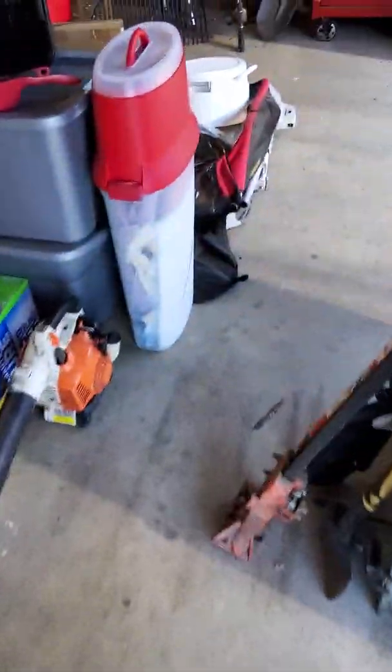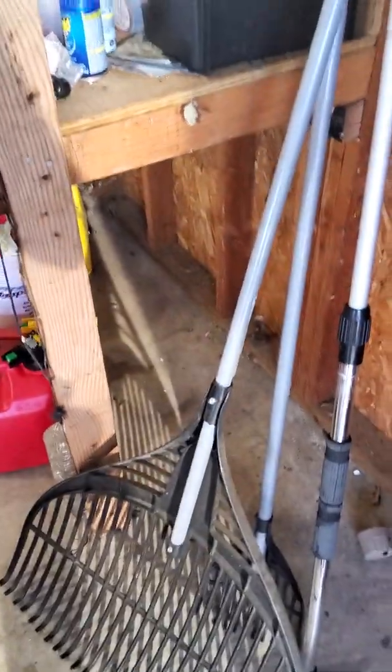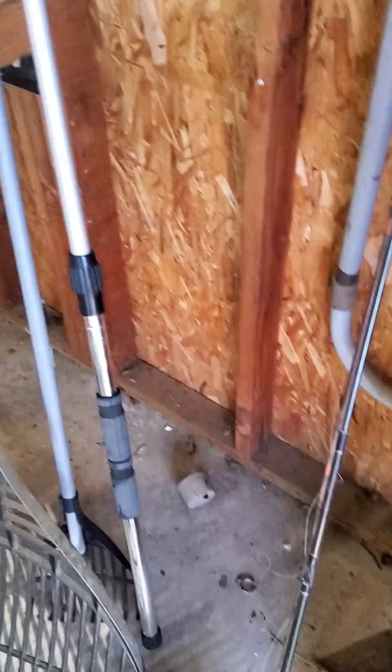So first and foremost, let's go over the garage portion. Obviously, we've got sill plates that are level, which are on, and that means they're on the slab. That also means that when you see your siding, it's not going to be 6 inches away from dirt like home inspectors want, because that's impossible when your sill plate's flat on the slab.